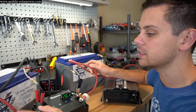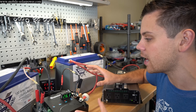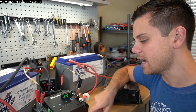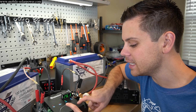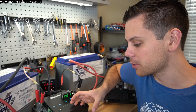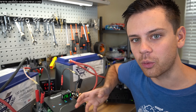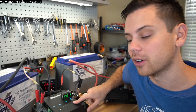For cable sizing, the manual says four or six gauge is acceptable, but I'm going to recommend everyone use four gauge copper wire — absolutely. I think the van life and RV crowd are going to love these units. The main reason more people aren't using them is that the manual doesn't explain everything clearly — like how to change the battery type. But with this video and a schematic available, I think a lot of people will start buying these.